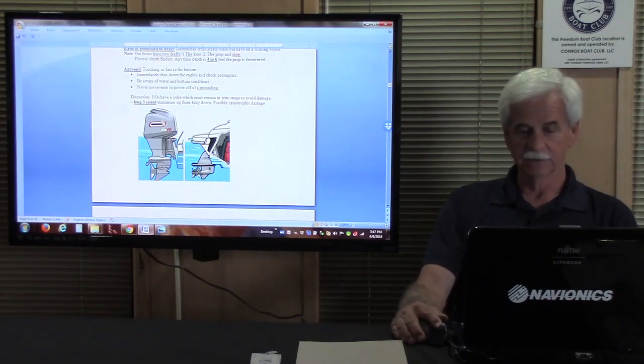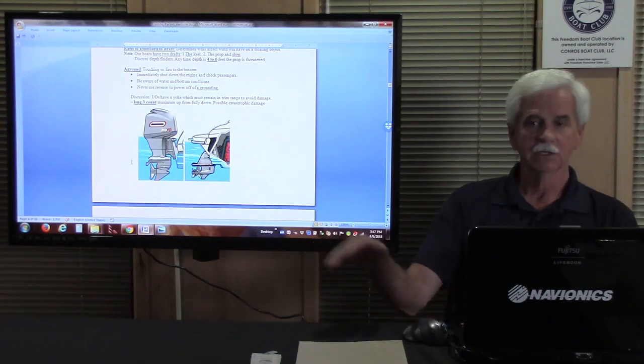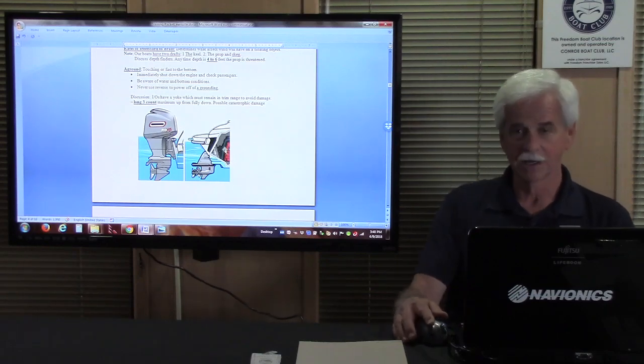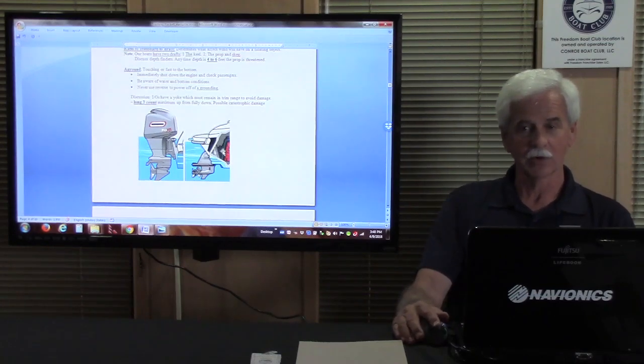Another consideration is on this boat we have, on the outboard, the motor and transmission all in a straight line. I can trim this motor up as high as I want to, up to the anti-cavitation plate, just so long as the operating telltale, which is a little stream of water coming out of there, is still pumping water. You're okay, you're not going to hurt anything. Absolutely, positively and unequivocally not true on an inboard outboard.